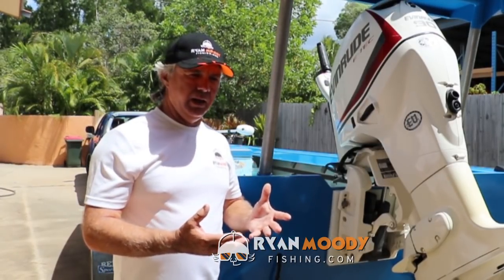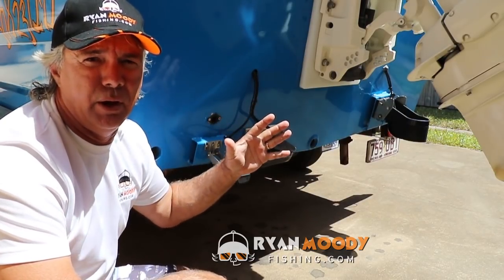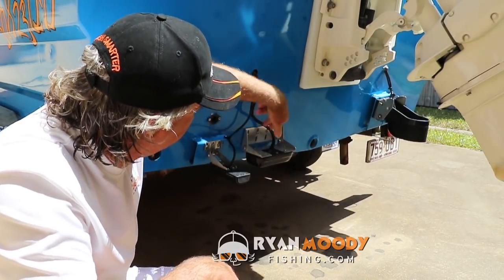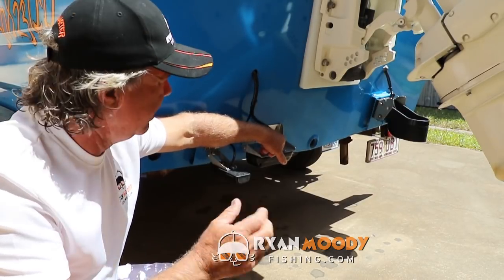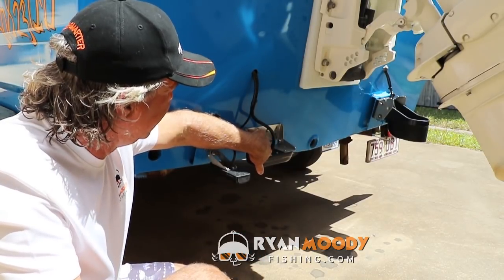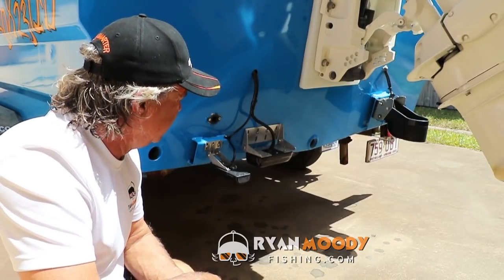All you want is a gentle circulation when running at speed. The other benefit of having holes in the bottom, especially forward in the tank, is that it allows things like herring that shed scales, and even prawns, to flush that debris out of the tank so the fish aren't choking on particles. Another great benefit of having these sealed boxes built into the back of your boat is that you can mount transducers into that sealed compartment without worrying about holes drilled in your boat potentially leaking into other parts due to electrolysis.